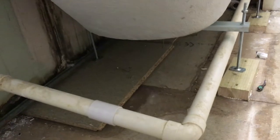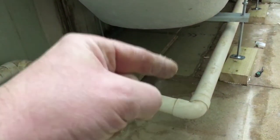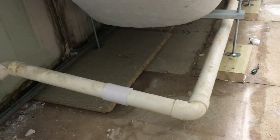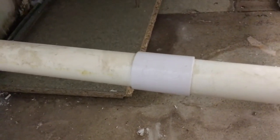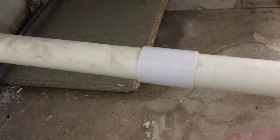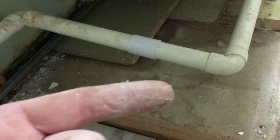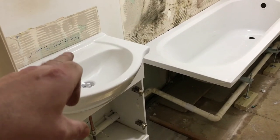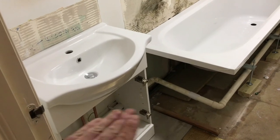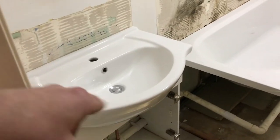I just need to get the fall right here and make some sort of block, attach it to the floor, and get a bracket — a clip — to hold the pipe in place. There's a coupler — that's what I was showing you when I was using the solvent weld. Basically the pipe just jumps in both sides. I've got it all over my hand, you can see. So tomorrow I'll pretty much fit the tap, get all this plumbing connected, get the shelf in, get the doors back on, get it secured — the cabinet secured to the wall with the ceramic still loose.